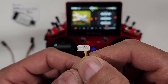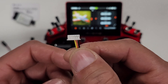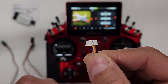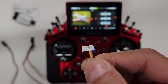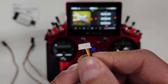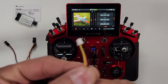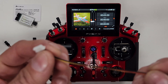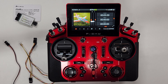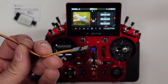The receiver we're working with today is the Archer SR6. It has a port that accepts this Molex-style pin. The way it's configured is: negative, power, and then your data cable — in this case the third slot represents S-port. The fourth slot, which is not present, is your AIN pin, and the last two pins are your S-bus in and S-bus out respectively. The Archer SR6 does not have F-bus, but that's okay because the sensor will run off both. Today we'll be dealing with S-port.